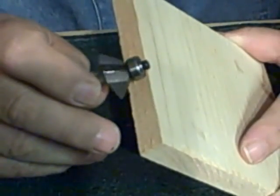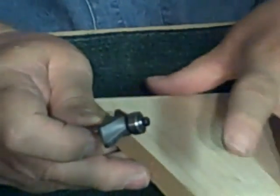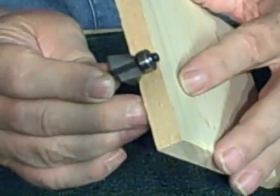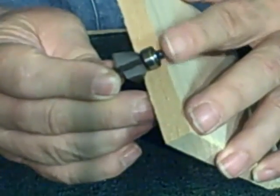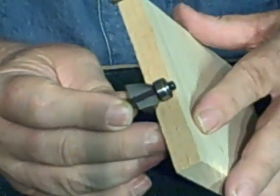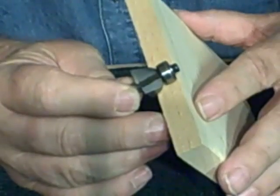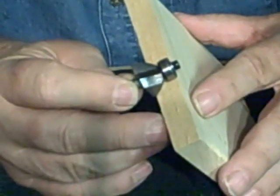Here's that 45-degree chamfer bit. When we set it to do the scallop you just saw, we set it so the flute comes clear down to the top — this being the bottom of the board — the flute comes down to where it cuts almost into it. Now you'll notice that if this were flat on a table, the screw on the bottom of the bearing would be digging into the table. So we have a cure for that — a couple of ways to do it — but I'm going to show you one I recommend that we just discovered not too long ago: bench cookies, made by Rockler. We don't sell them, but you can go on Rockler's website and buy them.